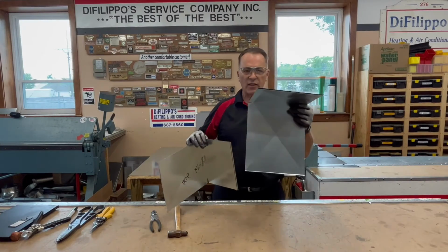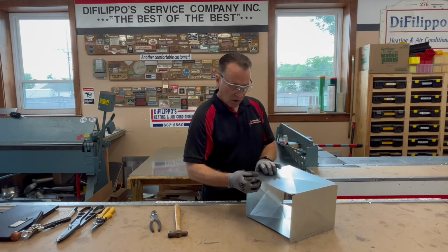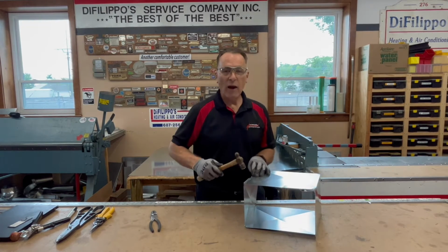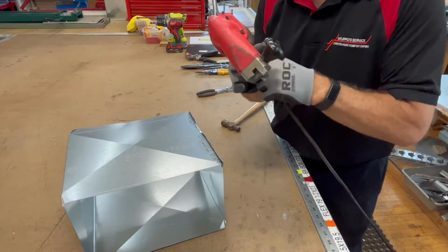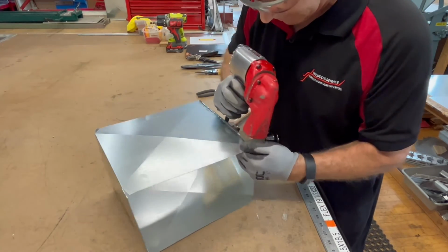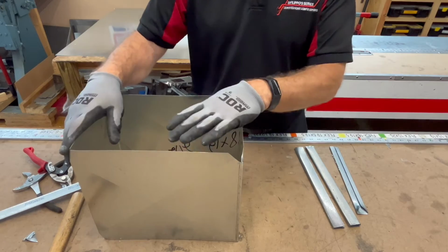There's the two sides. Pittsburgh on one side, 1/4-inch bend on the other. So all we do now is put them together. The 1/4-inch bend goes neatly into the Pittsburgh. And now we just put it together. So we banged it over. Now we have this electric machine that'll automatically do it. So hold your ears. Okay, so now we made a square duct.